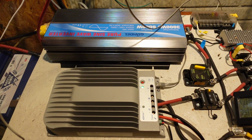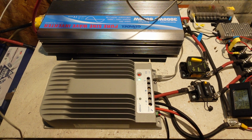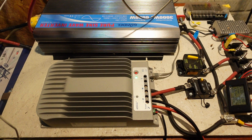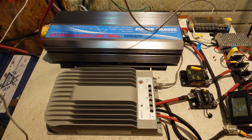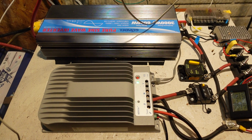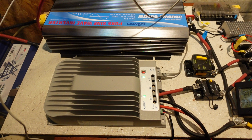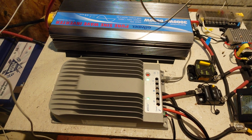And the link I'm going to give you from Will Prowse for this system, it's called 24 volt, 400 watt. Actually, it'll do over 1,000 watts. I have 8 100 watt panels on the roof. So, works fine. But they are run in 2 series of 4 into parallel. I don't want to confuse you, but when you run in parallel, it drops the voltage down and the amperage goes up. So that's what I did. Recommended to me from some old guy who lived out in the Caribbean on an island.